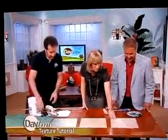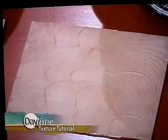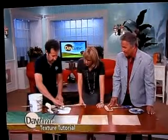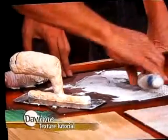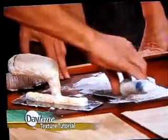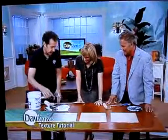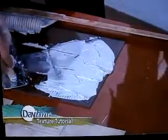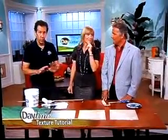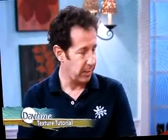This is interesting — it almost looks like a fish scale. You can do that again, starting with the same base here. You're just turning your tool like this. You just go from the top to the bottom and twist it like that, and you're going to get that type of pattern. You can use a bigger tool or a smaller tool. Could you do this over a really hideous wallpaper? You could, if you put an oil primer down first to seal everything. Then absolutely.